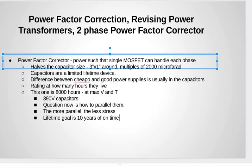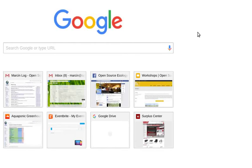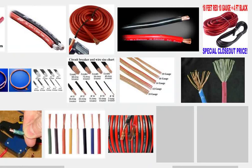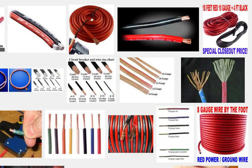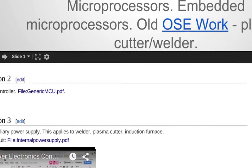It's not a fine line to solder. The connector for the capacitors is number 10 gauge wire — that's about a sixteenth of an inch, similar to household wire like 14 or 12 gauge, but a little thicker. That's fine to solder. You'd need around a hundred-watt soldering iron.